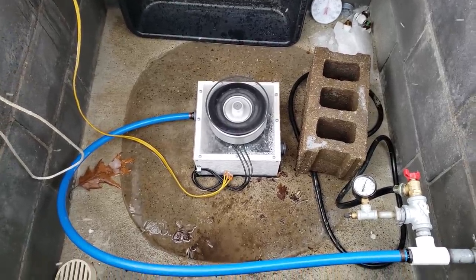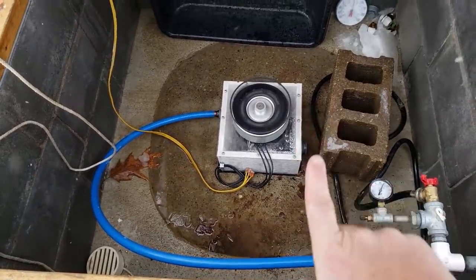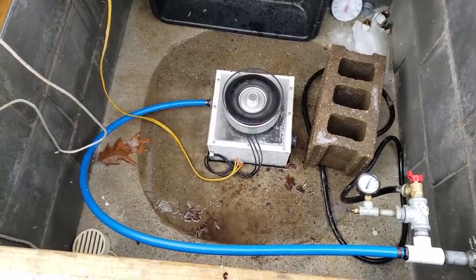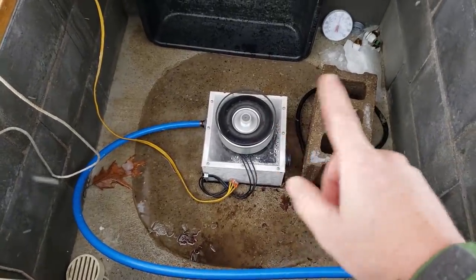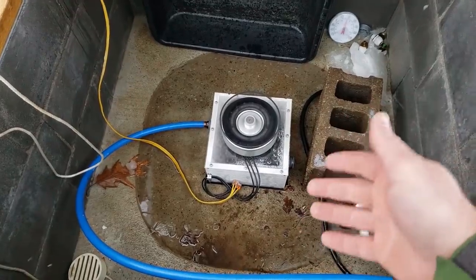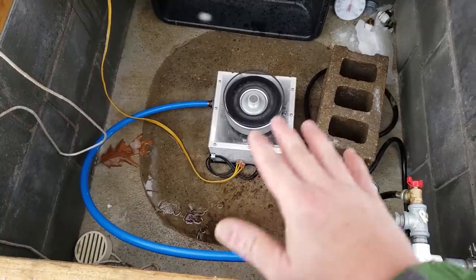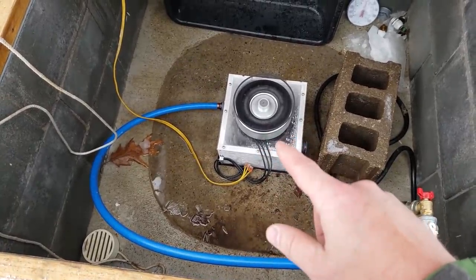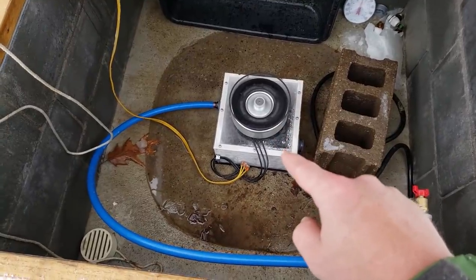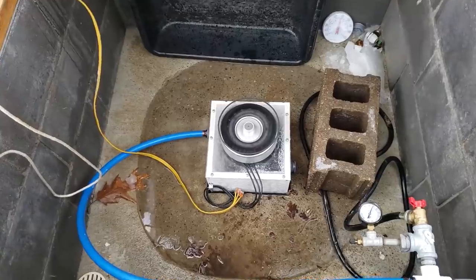In the last video I had the turbine turned up on its edge, so the axis was pointing this direction instead of this direction, and that was flinging a lot of water. During my entire 12 days of vacation it was flinging water and everything in here was just soaked, so I moved everything inside and put the turbine in this axis. I rebuilt the housing a little bit to make it how you see it now.